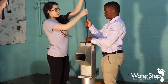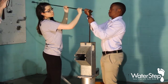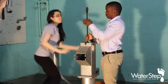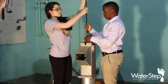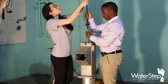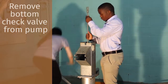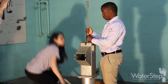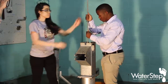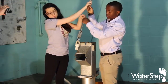Hand over hand, you bring them all the way up until you have removed all of the sucker rods. There may be five or six or there may be 15 or 20 sucker rods depending upon the depth of the well. As you remove the last sucker rod, you're now working with your retrieval tool. You bring your retrieval tool all the way back out, then bring it over and away from the top of the well — and there is your bottom check valve.